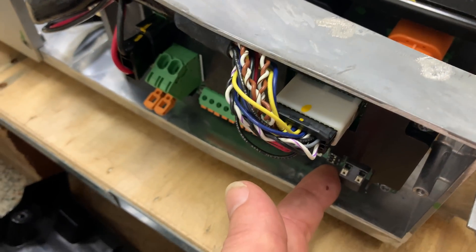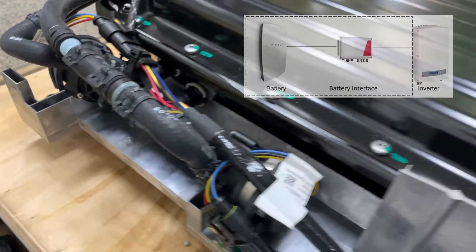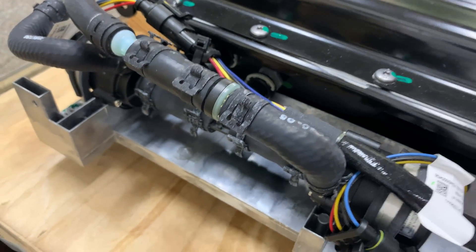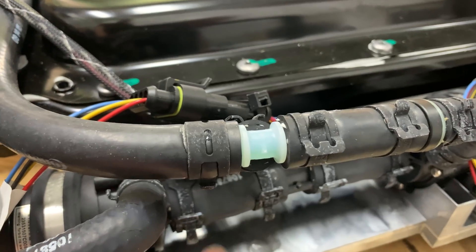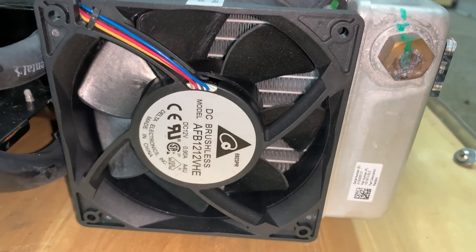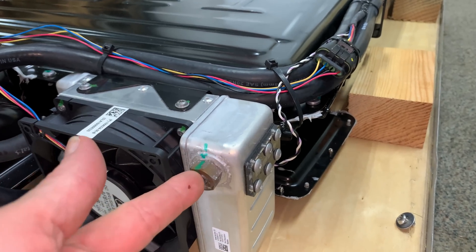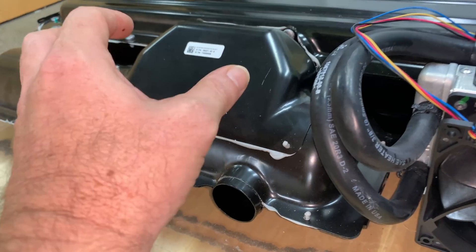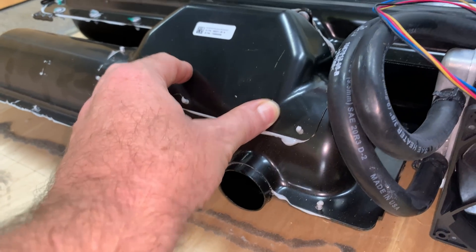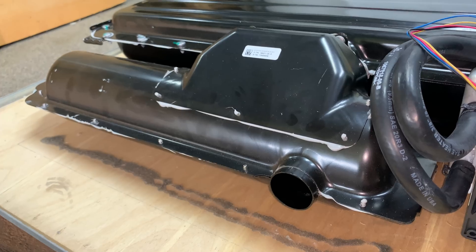The cooling system all starts here — it draws 12 volts from the battery interface device and comes around the back, then feeds into the two motors on the right-hand side at the bottom of the unit. We've got the spigot coming out of the bottom of the Powerwall, branching off into the two pumps — I presume that's redundancy — then heads up the side. Around the top we've got a 12-volt 0.9-amp fan and a radiator behind it, with a header tank where you fill it up and a fluid level indicator on the side. Beside the radiator at the top there's another device — I'm assuming it has something to do with venting the battery should that situation arise.